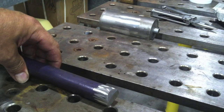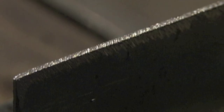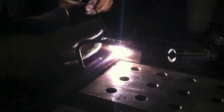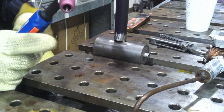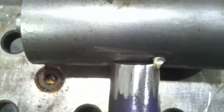Alright, here's the hammer. I got a piece of one-inch round stock out of the scrap bin — it's just a drop — and this piece of two-inch that was cut for a one-time use driving some kind of bushing out. Before I do all that thick stuff and show you the thick capability of the machine, I'm lighting up on a piece of 0.040-inch thick cold roll just to show you the machine's got both the low end and the high end. When you plug the foot pedal in, the Everlast 160's digital readout reads zero because you've got the full range from bottom to top with the stroke of the foot pedal. I'm going to be going pretty much full pedal, but it's going to be enough.